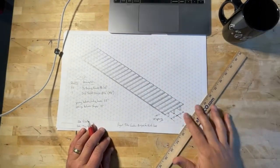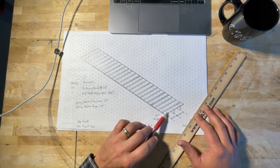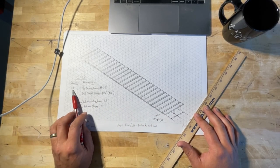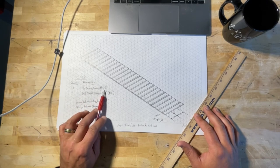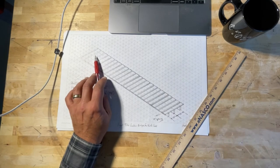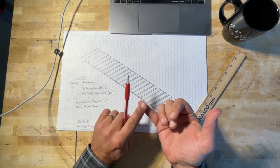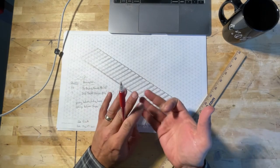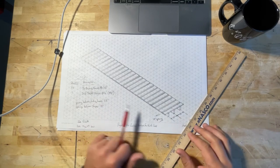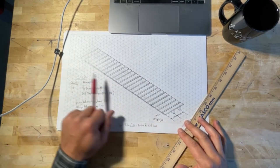We've got our cut list made here. Stringers, we just have to talk about how to lay this out now. So the other question would be, out of 24 pieces at 36 inches, what is a good length of decking board to start with to cut these down to have zero waste? So should we order 8-footers, 10-footers, 12s, 14, 16s? They come in all those lengths. Our stringers, we want those to be intact and full length, so we want a 16-foot stringer.